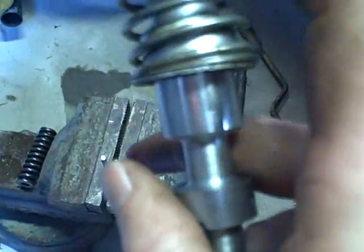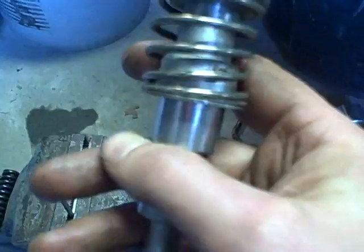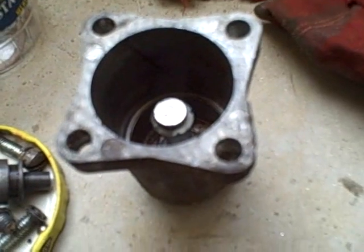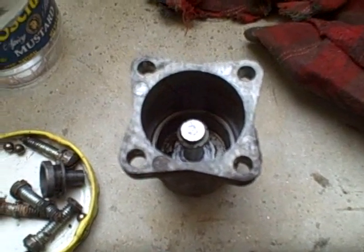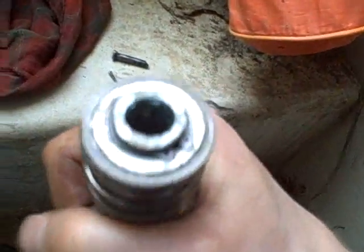And the way this works is there's a cup, so that when you slide this down, the cup will allow those little balls to move into the holes further, and that will allow you to insert that pin that's on the inside of the cup here, right down in there. And as luck would have it, that pin on the end there looks like it's got a bevel to it, so I think it might just push and snap in, which would be nice, but we'll put grease on that too. Okay, I don't know if you can see it, but all 4 of the balls are in.